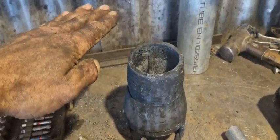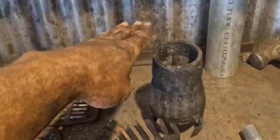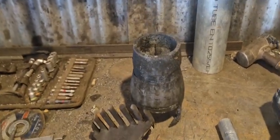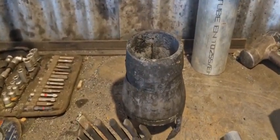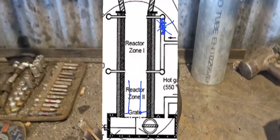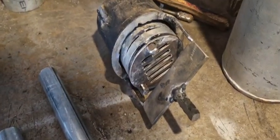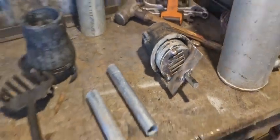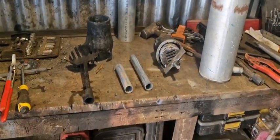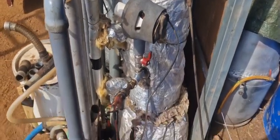This was the other one I made — a restriction from six to four to six centimeters above. This is the first air belt, and in this mode it runs like a normal Imbert stratified gasifier because I plugged the second stage. So for this experiment it's completely an Imbert-style experiment. Let's see what it does with the temperatures, and we're running gasifying now — let's start it up on the ignition plug.